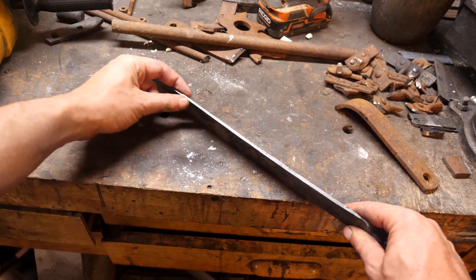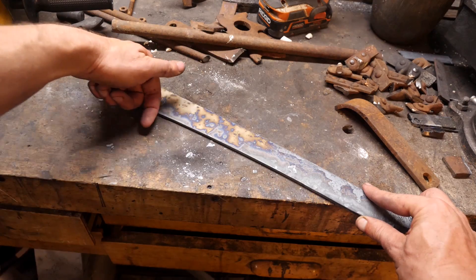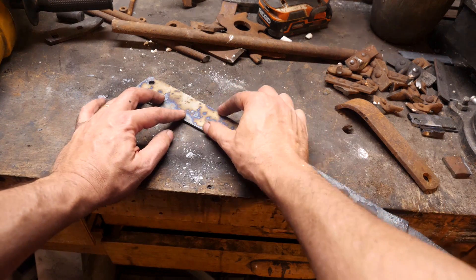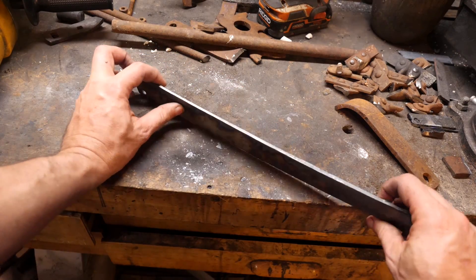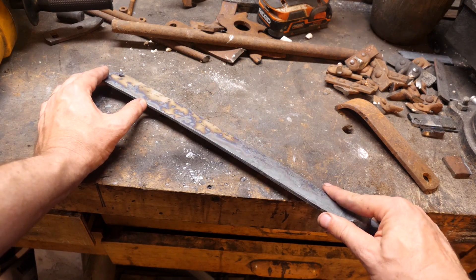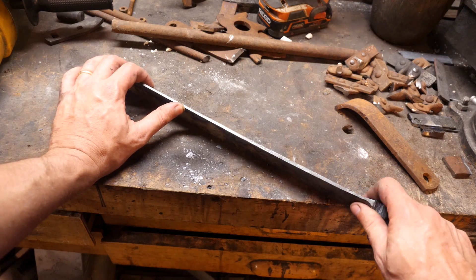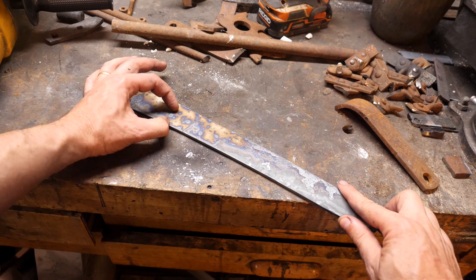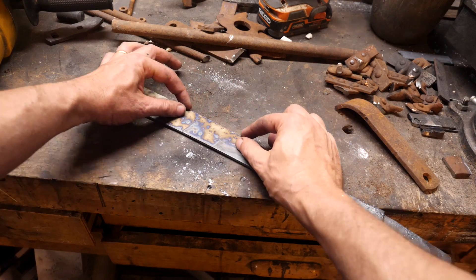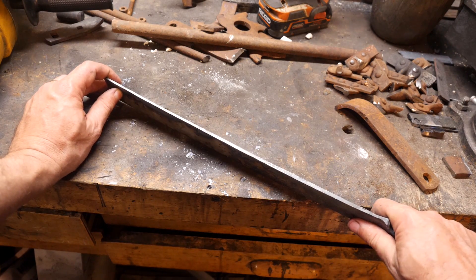You've probably noticed this is really thick. I could have forged this thinner, which would have brought the material down and meant less grinding to get an edge, and I'd leave more of it jacketed along the sides. But the weight is the issue here - this is just too clunky and heavy. So I can leave it like this and grind the bevels to remove quite a bit of material, but it pushes the grind line back. Since our outer coating is so thin, only a very thin area of the spine is ultimately going to be jacketed, which isn't the intent of this project, but that's just how it's going to have to be because I've got to get some weight off this thing.